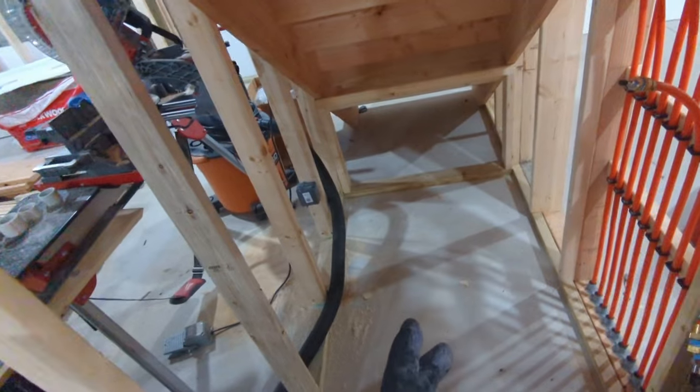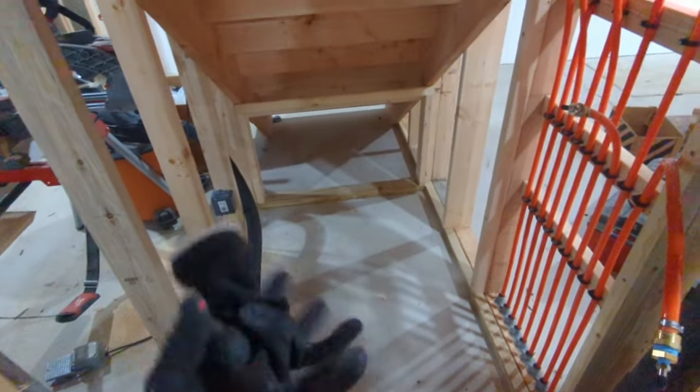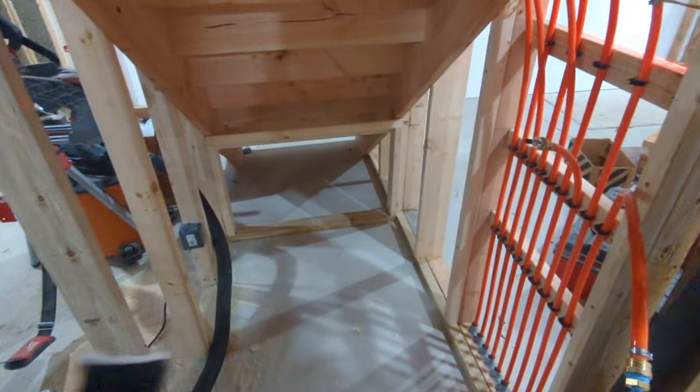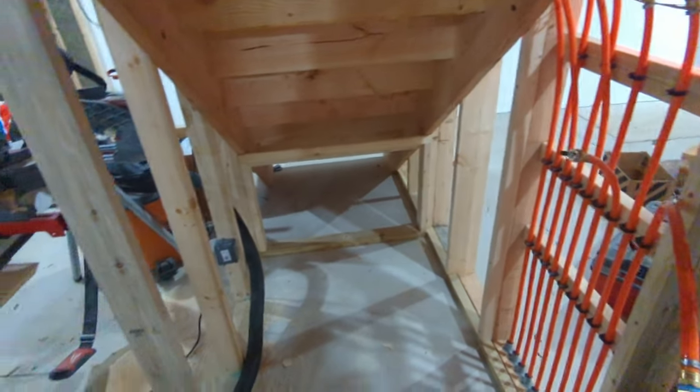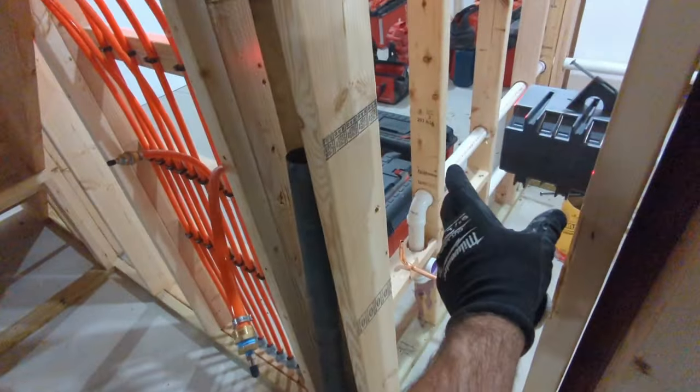I don't want any outlets in this space, because you really aren't going to leave the door hang open, plug things in, and utilize things out here. And if you give somebody an outlet to plug in a charger or whatever else, trickle charger or something like that, and they close this place up and forget about it, and you have electrical failure in here, it starts a fire. So I'm just not going to give anybody an outlet in here. But I would like to see a light switch here.